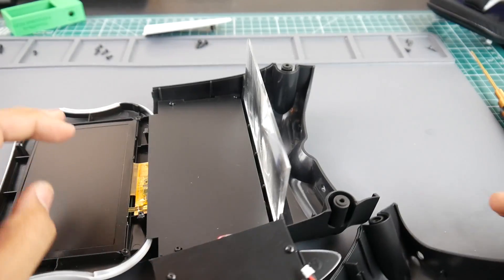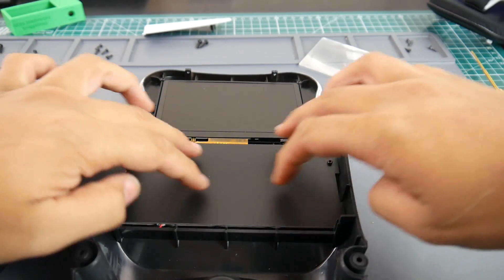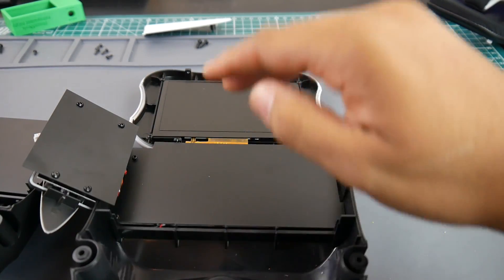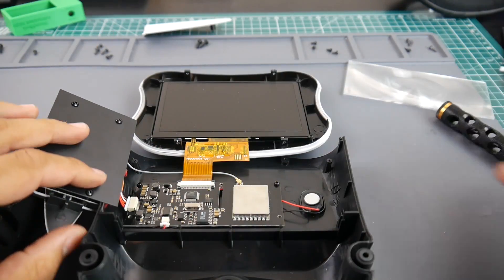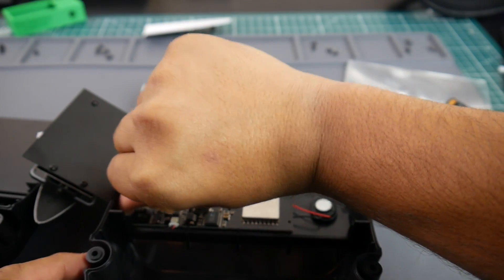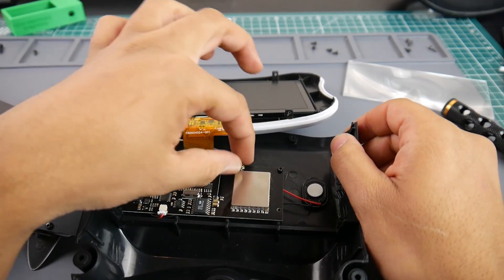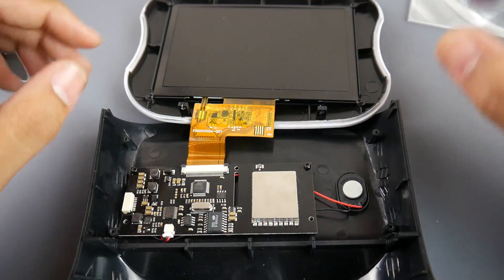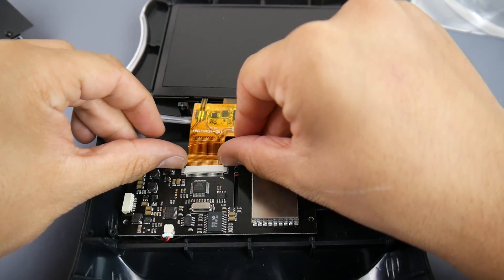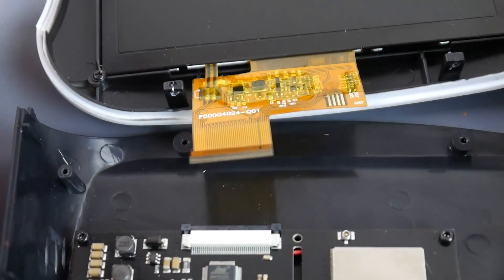Once that's disconnected we still have the wire for the receiver plugged into the IPEX port, so push that to the side and be extra careful. Next, go ahead and remove the lens. There are four 1.5 millimeter hex screws — remove this cover which covers the diversity module as well as the LCD drivers. Once all four screws are removed you can lift it right up and take a look at the main board. There's also a little connector there which I highly recommend you remove as well.